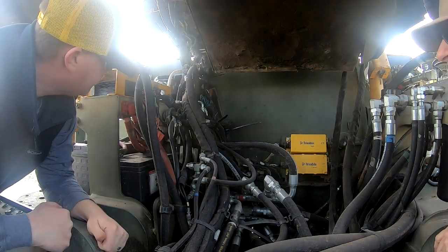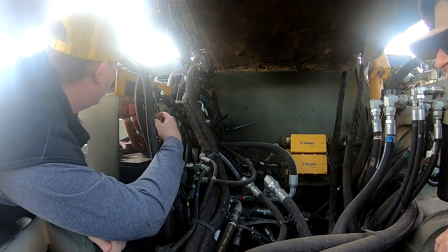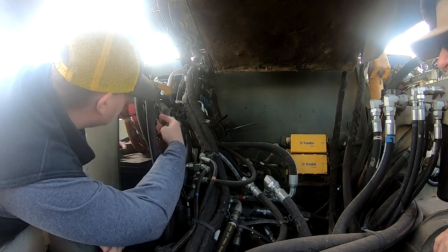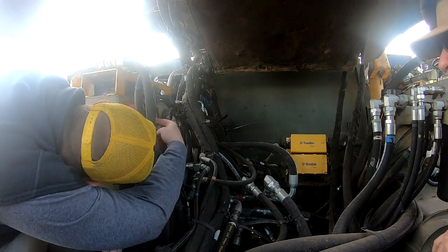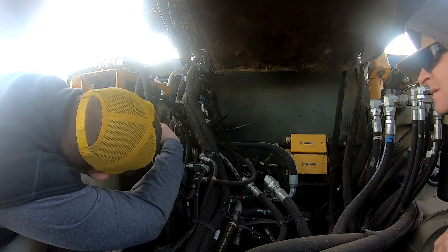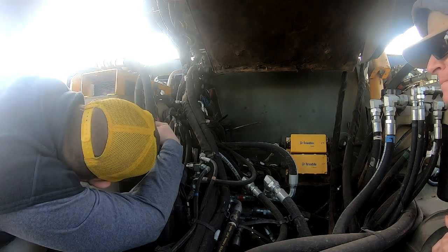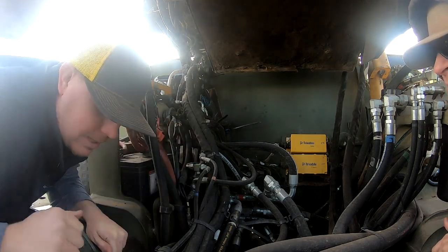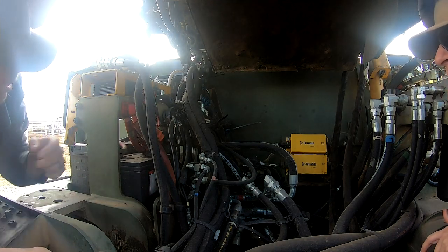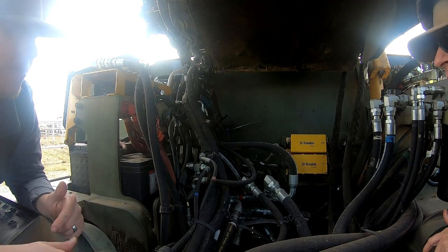You just want to run a hot wire from that? There's some inline fuses. I would think that's all 12 volt right here. You could just tie into one of these. With the inline, you want a fuse on that deal. But see, there's a little junction box right here you can tie into, but I don't know. I guess I just need to test and see if all that's 12 volt. Make sure it ain't 24 volt out of this junction box. So it'd be easy to tie into the junction box with a little eye.